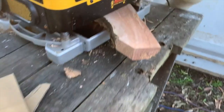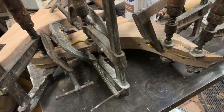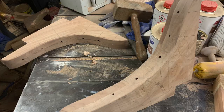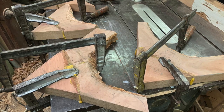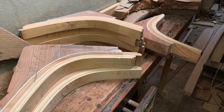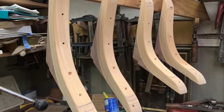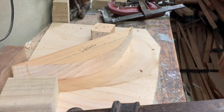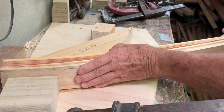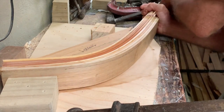The other knees that will be hidden behind furniture will be painted, so I chose to laminate them. With natural crooks becoming harder to get, I've occasionally fitted graving pieces to imperfections and even added filler blocks to get the width. I laminated a bunch of knees from silver ash with some celery top pine, huon pine and Tasmanian myrtle. Some of the curves would have required very thin laminates to bend around dry, which means more waste, more glue and more time, so I cut my laminates mostly around four or five millimetres thick and steam bent them on a jig.